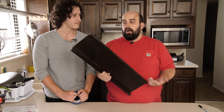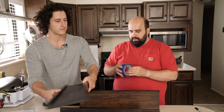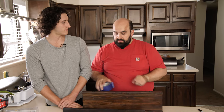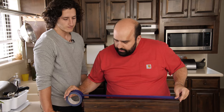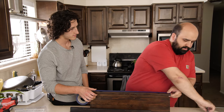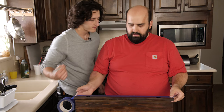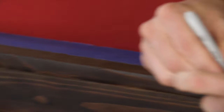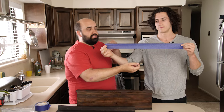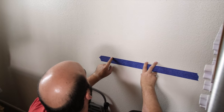This is what I've decided to install. All these shelves have two points on the back, and there's a fun little trick we can use to transfer the holes from my shelf to the wall and get them straight every time. If you take some painter's tape and line it up right here in the back holes, and on the edge of the tape, right in the center of the holes, go ahead and make a little mark. Now what we have is a stencil — we can stick this on the wall where we want to hang it and know right where those holes need to go. My holes are going to go here and here, which should bypass the stud, the electrical wire, and the other stud over here.